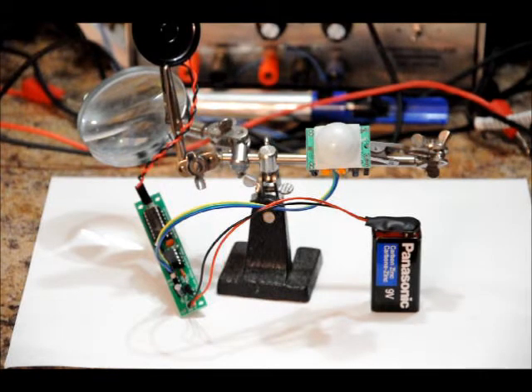So there's the main board with a 9-volt battery connector. You will have the option of purchasing this with an AC adapter as opposed to a battery — it will be a bit louder. It will come with a PIR sensor that connects to the board and a 0.5-watt speaker. And if you want it to be louder, you can take the speaker outputs and connect it to an audio amplifier. You can also mount it to a project box.